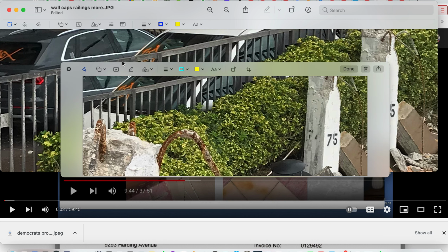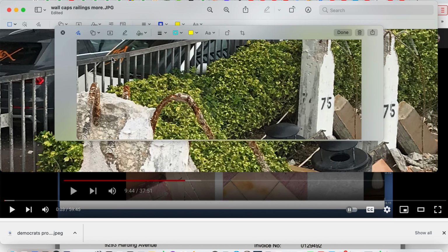I want this to be questioned, and I want you to think of this as number 5 steel. All right, that's 5/8. And at the bottom it said we'll have number 4. That's 1/2 inch steel here. So they created an upside down beam. This is stronger at the top than at the bottom. This, of course, will take the deflection, but to deflect, this number 5 is going to resist. It's going to be more rigid. It's going to intercept that deflection to some degree.